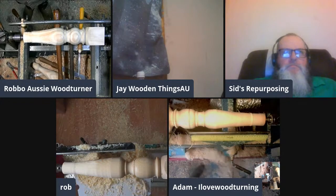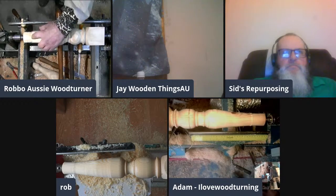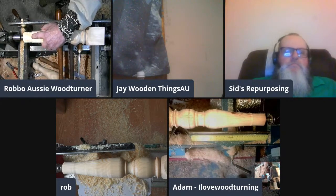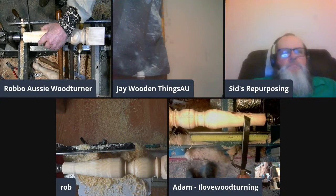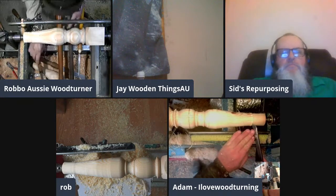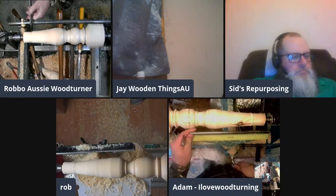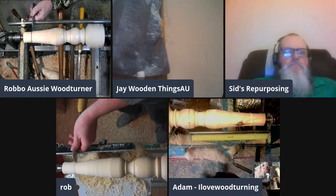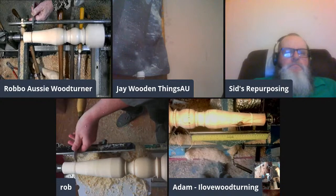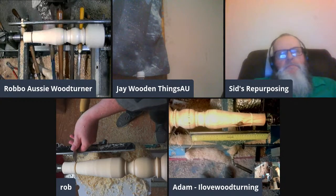Now with your skew chisel, where that 50mm line was down here, I won't put it on full screen, go 3/8 of an inch deep again. No, it's a V cut. You've got to go in on a V cut. So long point down. Pick up the line, then widen it out. So about 8 to 10 millimeters deep.